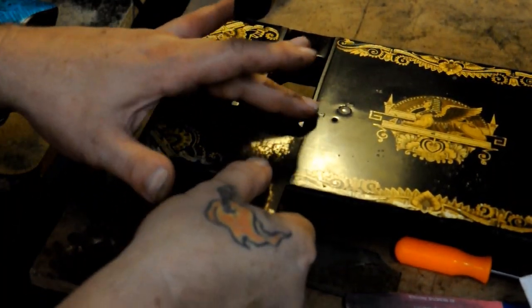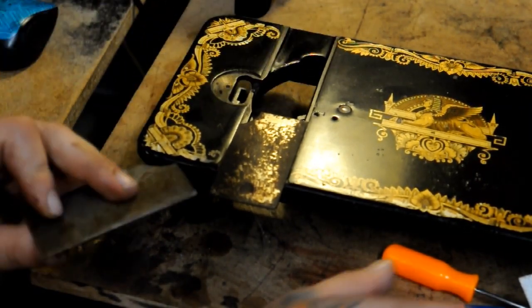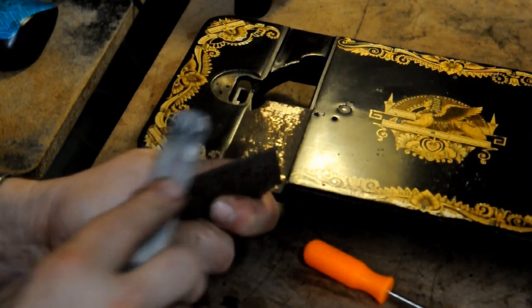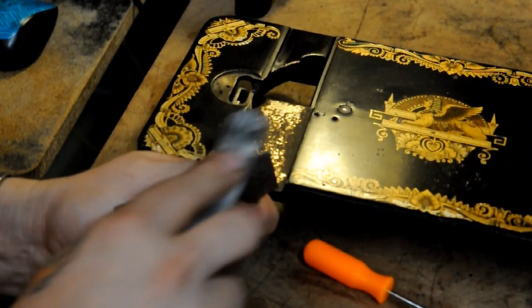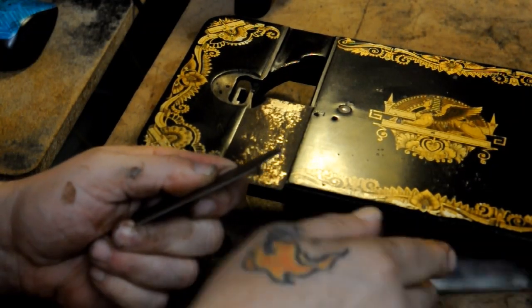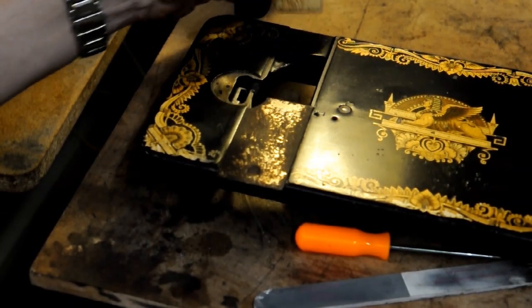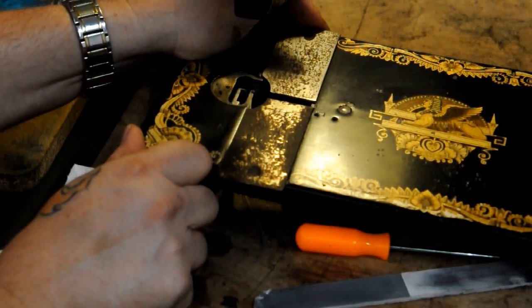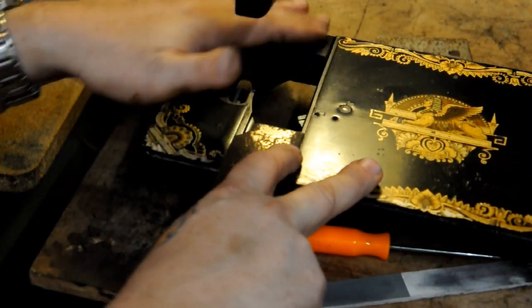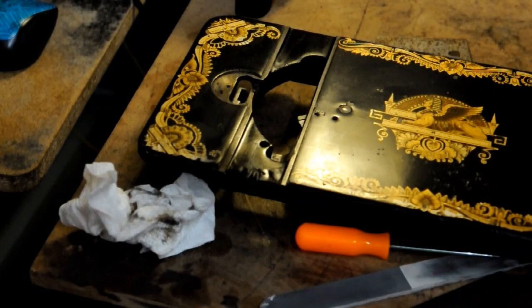Oh, that's moving nicely right now. Just when cleaning the other tracks, the other one was a little sticky. Let's see how that one's doing. Yeah, it's still a little sticky, but I didn't touch this yet. So, anyway, yeah, these flexible nail files. This particular one has four grits on it. I'm not sure exactly what the grits are. I use these a lot for polishing other metal parts, which you'll see later on when we get to like the presser foot and stuff. But you can get that surface clean. You get it clean and shiny, and the back one should have a little resistance, so that's actually pretty good. Yeah, so that's about the way you want it to move, because you don't want the fabric pulling that through. All right, let me get back to polishing the rest of this beast. It's coming along. It's almost there.